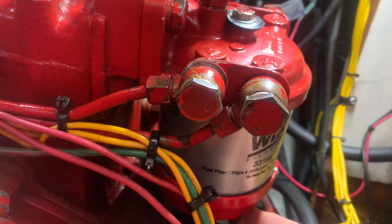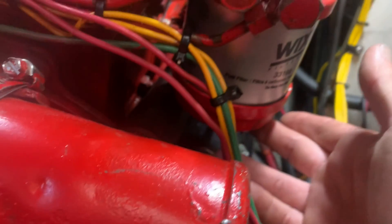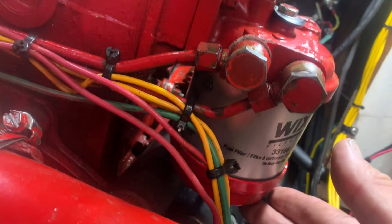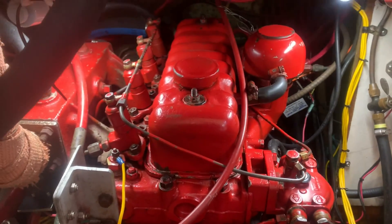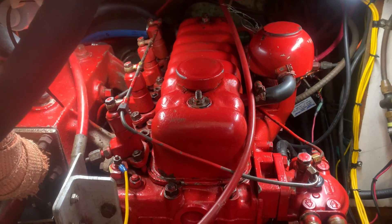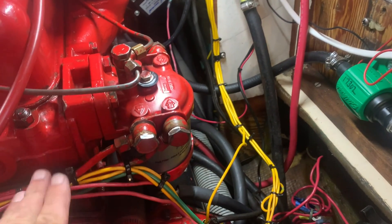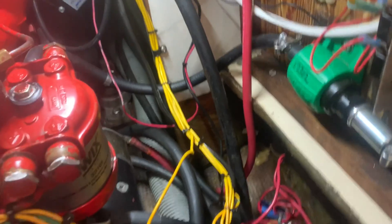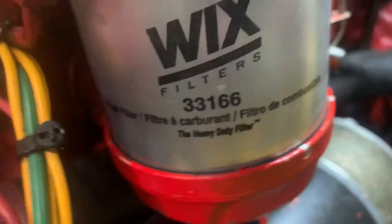That's the one we're going to change — the one you'll find on a lot of other engines. Common to a lot of diesel fuel systems is the lift pump, which feeds into a filter, then through lines into an injector pump. The injector pump feeds the fuel injectors and has a low-pressure side and a high-pressure side. This will all become apparent when we have to bleed the system, because we're going to get air into it by changing this filter and the whole idea is to get as much air out before we can start it.